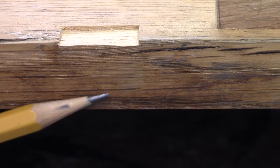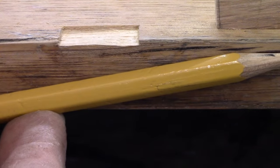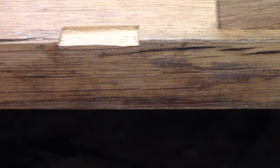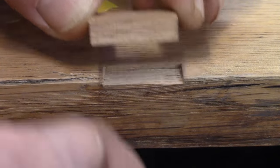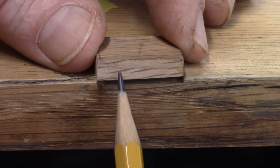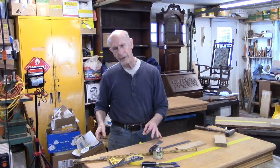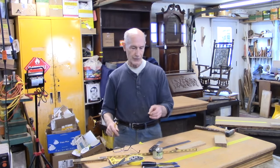Here's the side grain of the table. You know, this quarter sawn wood, it's fairly straight, but you can see it's going up at an angle. These pieces, definitely going at an angle. This is what caused this defect. But the grain is going in general in that direction. So with my patch, this grain's going down. There you go. Now it's headed up in the same direction as this grain. It seems like a minor thing, and with this wood, it shouldn't be much of a problem, but the chatoyance of the wood needs to be the same, or it may make this impossible to touch up.